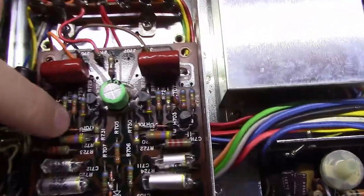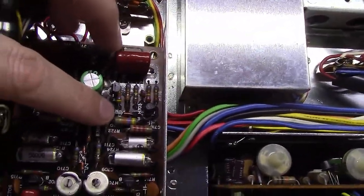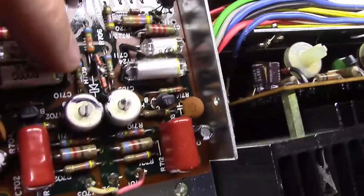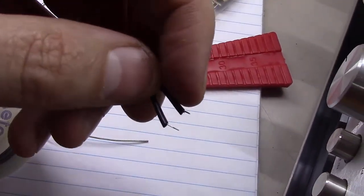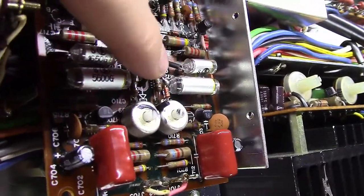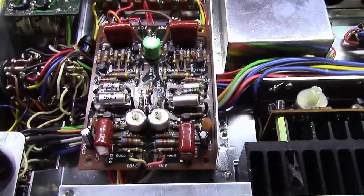The diodes are in. Instead of standing them way up in the air, I used some lead benders to bend the leads over and drop them all the way down, with the polarity right. For the series diode pair near these metal pots, the adjacency was so close that I took some black sheathing — just wire cover — off an existing wire and mounted that pair up in the air slightly to make sure no leads end up touching. Feels good now.